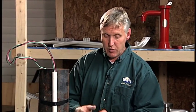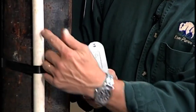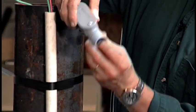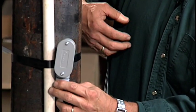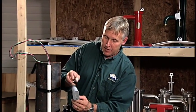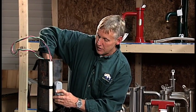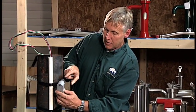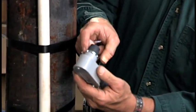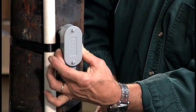After that hole is drilled out, we can install the plastic conduit L. You're going to go down your outside conduit and cut it off — cut that piece of plastic because this adapter is now going to sit on top of your conduit. Through the hole you've drilled, insert this threaded nipple: take one of the lock washers off, leave one on, push it through the hole, then take your lock nut and screw it on the back side and tighten it up. Put a bead of silicone right around this nut for a nice watertight seal, then push it into the hole and lock it on the back side. Then your conduit L will be in place.